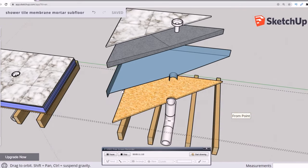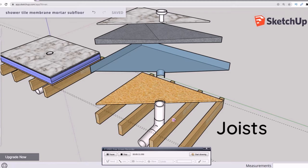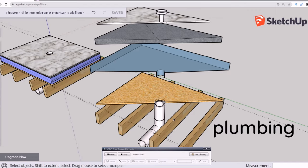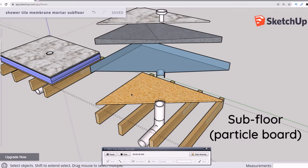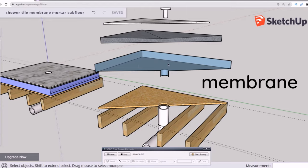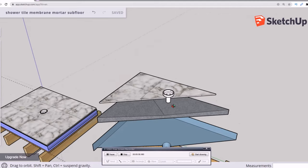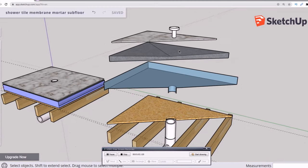I did a quick drawing to explain how the layers work. At the bottom we've got the floor joists, then a layer of particle board flooring with the plumbing coming through. On top of that subfloor is a membrane that gets painted on — almost like one complete skin down inside that pipe and then about 1500mm up the walls. On top of that membrane is a layer of mortar which shapes the fall of the floor, directing water to the centre. On top of that go the tiles and then the floor drain — the floor waste for your shower.